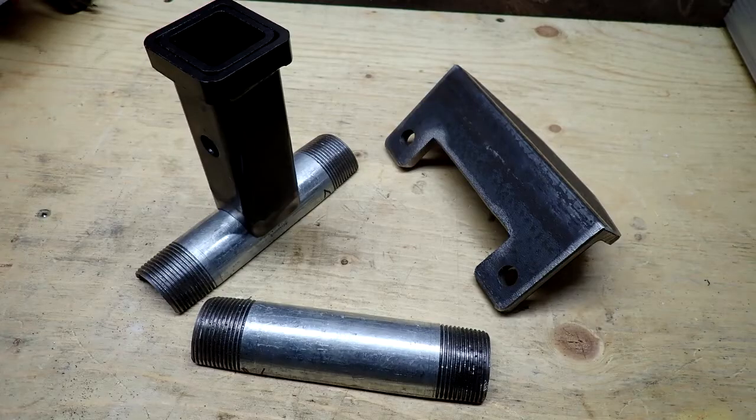Here's a picture of the four main parts that I'm using to build this front hitch. I do have drawings available for download, just check the description below. The receiver part is a prefab unit that I bought from Princess Auto — if you're American you could probably get one from Harbor Freight. The pipe you see that's galvanized is a six inch nipple, inch and a quarter internal diameter, and the part to the right is three inch angle, a quarter inch thick.